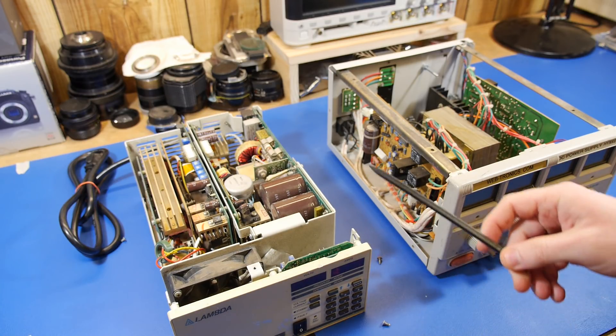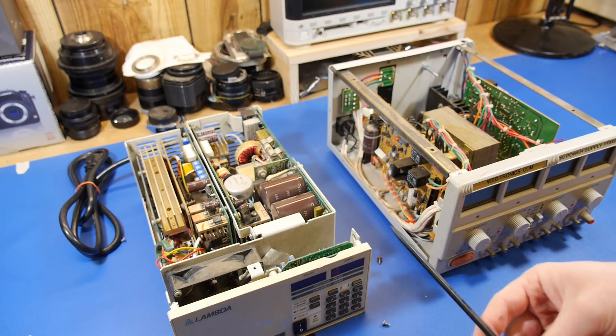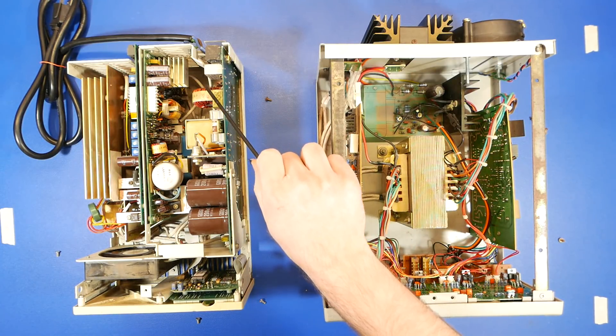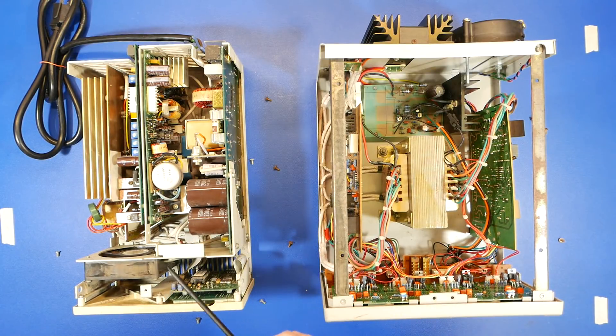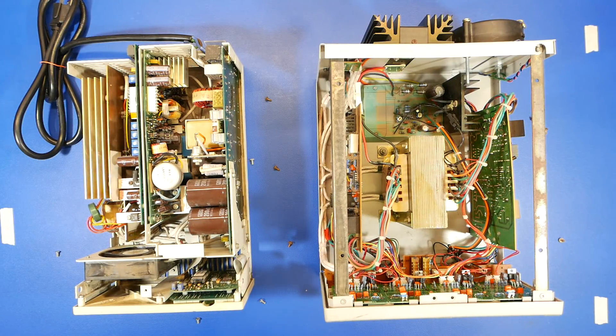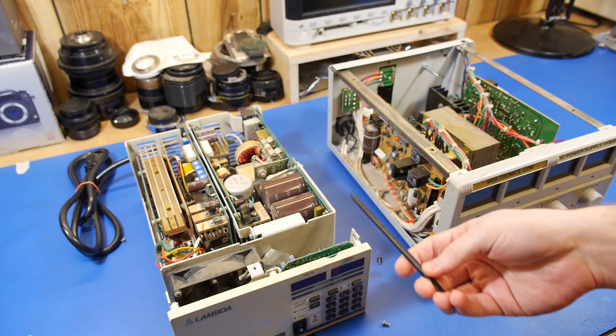A switching power supply is a lot more complicated — there's no one main transformer. In order to make a more efficient supply, instead of using one transformer at 50 Hz, it uses a combination of smaller transformers that operate at a much higher frequency. The benefit is that a transformer can be reduced in size at higher frequency — instead of 60 Hz, these transformers run at say 150 kHz or even close to a megahertz. Looking further at this power supply: you have main input voltage filtered by filtering capacitors and a common-mode choke, then a full-wave rectifier, large filtering capacitors, and a switching component that drives power MOSFETs toward the desired output voltage. I haven't quite found the switch mode IC yet, so I'm still looking for that in the teardown.